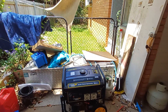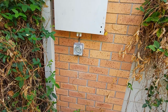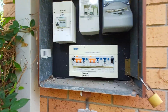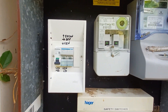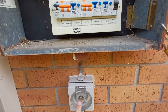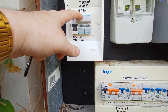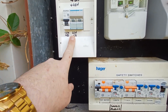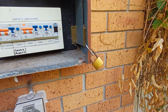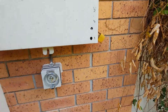Let me take you around and I'll show you the other stuff that I've got put on the house. I've got an electrician around, and this is the Australian standard that you have to have — a changeover switch. You plug your generator into here, and then I've got a changeover switch. Once you hook up your generator, you don't even have to turn off your main switch. You hook up your generator, you switch on your safety switch, then you pull this down once and then twice, and it goes over to generator power. Which I reckon is really cool. I just wanted to give a quick review on it because I couldn't find anything on YouTube about the Viking generator.